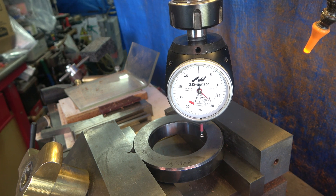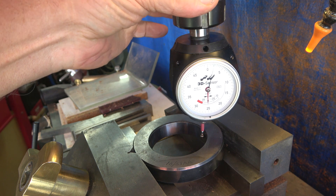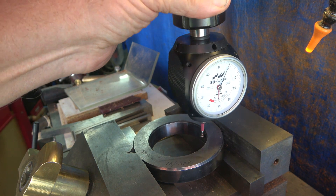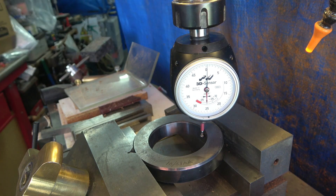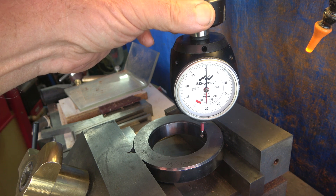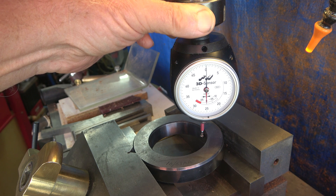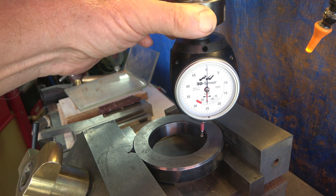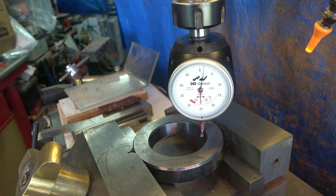What I discovered having a trial run is that it doesn't matter where you put this to take your initial reading, but once you've done it, don't move it. If I wind this over now and put that round two turns, you think okay it's fine — but if you rotate it, you can see it goes plus five, minus zero. I think it's because it's an X-Y system and by rotating it you're introducing what might be a cosine error, moving the stylus in two directions. So it doesn't matter where you put it, but leave it there.